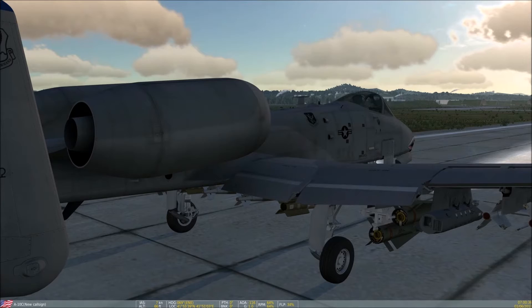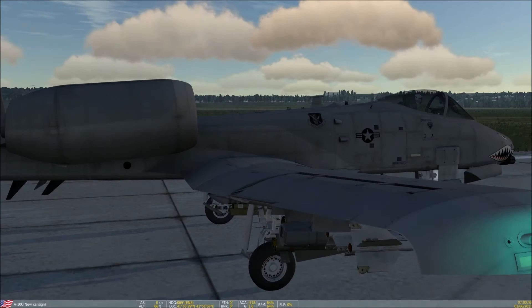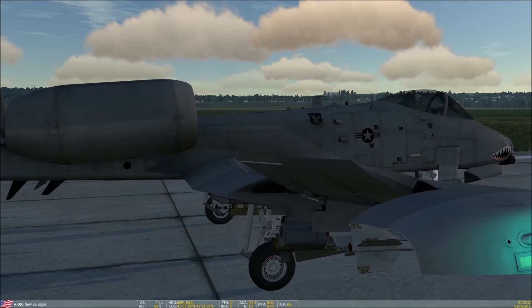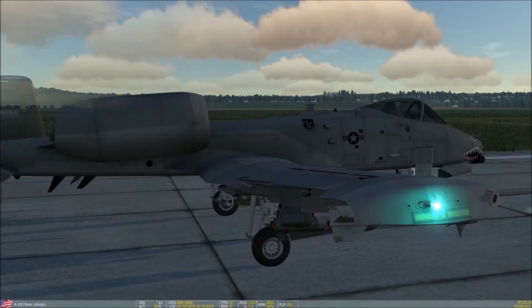On the trailing edge of the wings are the flaps, powered by hydraulics, divided into inner and outer sections that all raise and lower simultaneously. At each of the wing tips are the two ailerons, which allow the aircraft to roll. In addition to roll control, each aileron can also split vertically to form a speed brake. The ailerons are powered by hydraulics, and should one fail, the other takes over. If both hydraulics fail, the ailerons are backed up by a push rod and linkage system called the manual reversion flight control system. Should one aileron get jammed, there is an emergency disconnect switch to free it.